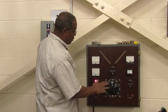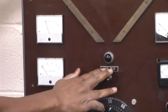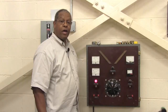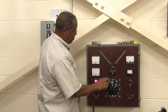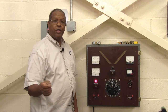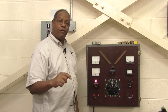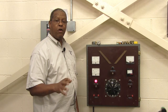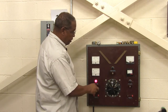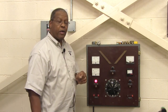This portion of the machine is where I'll be testing the fuses, which I will discuss individually. This copper bus bar will give me the continuity check I need for the various types of fuses to determine if a fuse is either good or bad. I'm going to leave the variac on as I go through the various types of fuses in the marketplace.